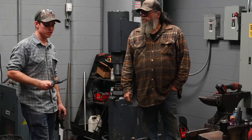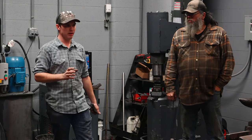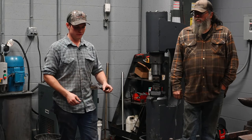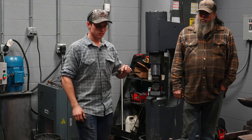What that does for me is give me 2 lines that I can divide in half by eye. I've got 4.5 inches. It's hard to divide that in half accurately by eye. So I'm going to lessen those marks down to maybe 1/4 inch. I can divide that in half by eye. As far as side to side, getting it centered does not matter because we're using round stock. If it's going off, all I have to do is tilt the billet a little bit. It's round, it can roll. If I'm using square stock, depending on how wide, I may scribe side to side as well to find a center in that direction.